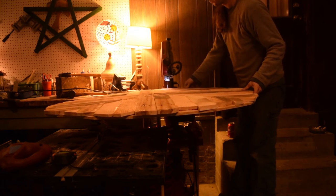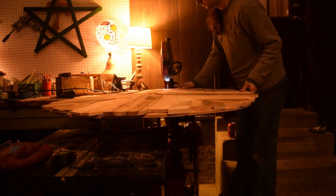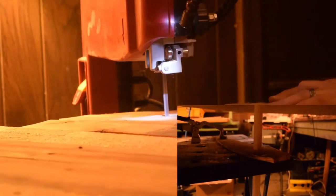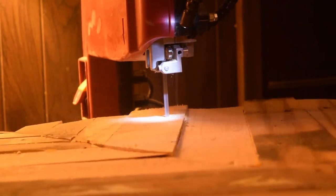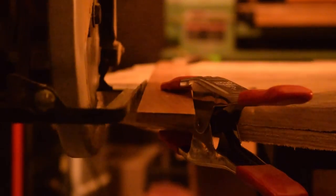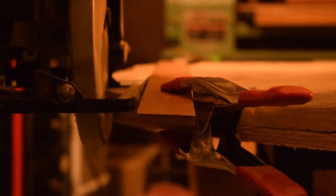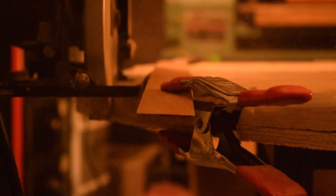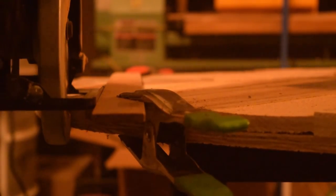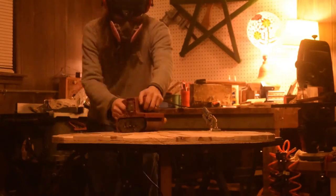I made this little makeshift circle jig for my bandsaw — I'll show you a close-up here. I put a dowel through my crag table, put a nail in the end of the dowel, and the nail hole went into a hole I drilled out in the center of my plywood. I was trying to balance this thing on the dowel — terrible idea. It ended up making a straight line on one side, so instead of fighting it I decided to go with it. I broke out the circular saw and cut off that side perfectly straight, flipped it over and cut off the other side perfectly straight — so it's like two flat sides on this table and two rounded ends. I kind of let the error suggest a style decision.